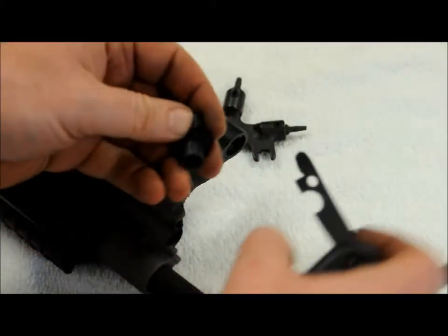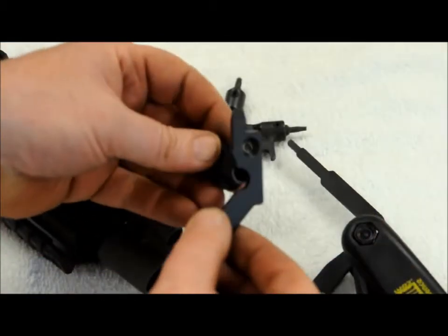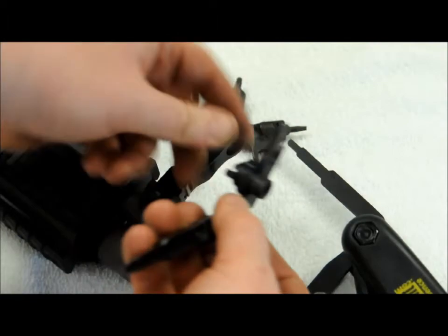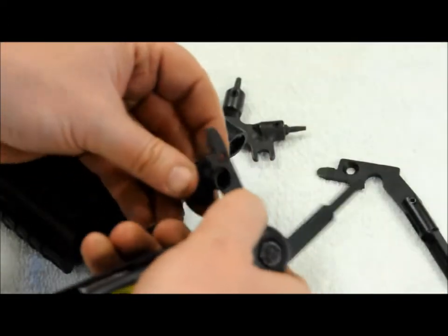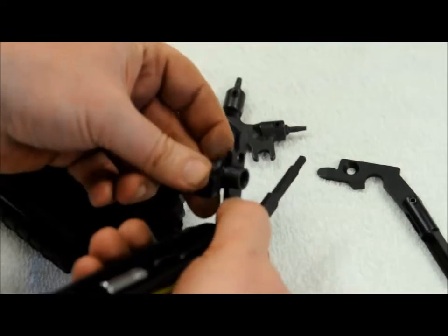You see a little semicircular cutout. In the original FN tool kit, that cutout is designed to fit around the gas valve and scrape along the bottom edge of it in order to remove any carbon deposits. Same thing in my tool kit — it fits around and scrapes the bottom edge there.